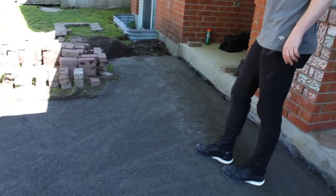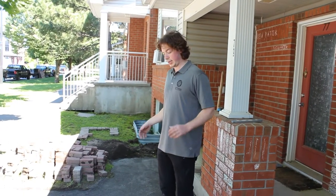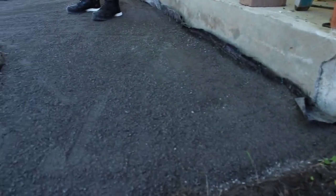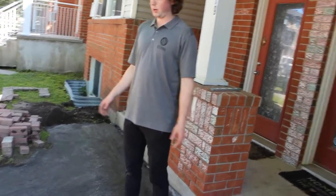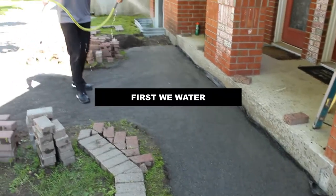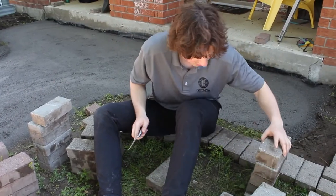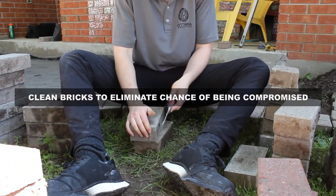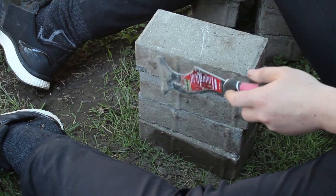We've now completed the first stone dust grade. I made some notes about how things compact a lot — sometimes too much — and these two corners drop when we compact. So I'm going to do some extra grading in the corners initially. The rest of it's looking great. We'll do a final grade then we can lay. I'll water it first, then compact, then grade again. I'm also making sure these bricks are squeaky clean so that when we put them back there's nothing compromising them.